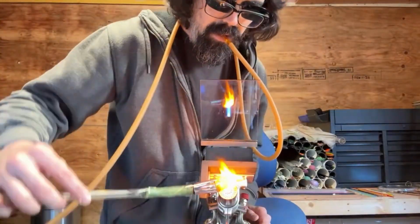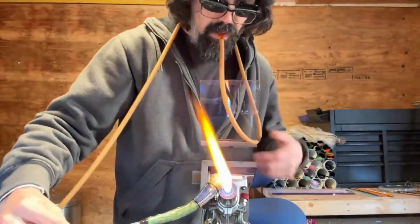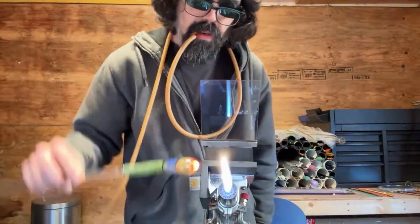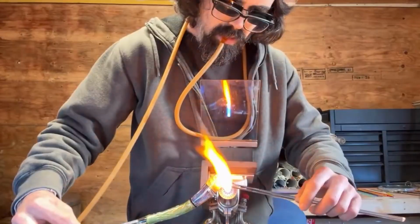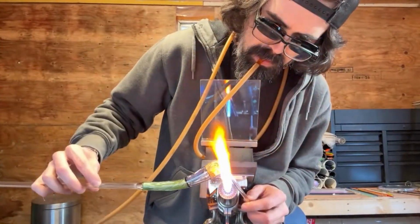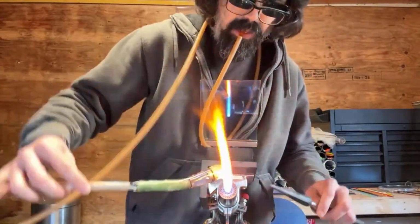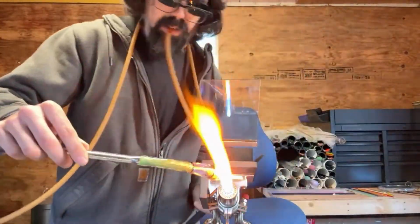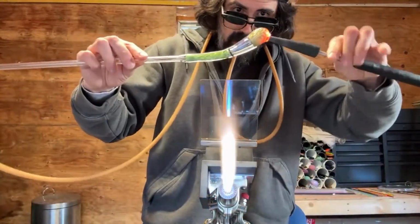And I'm going to pop that hole right where I want to get the right lean on that end of the piece. And I'm trying to open up the U shape a little bit, so I don't want that bubble too high up, because it can often be a spot where there's a lot of extra glass that condenses inside in between the 2 halves of the pipe. So now we're using the reamer to open up that hole, make sure it's nice and even.